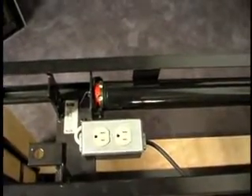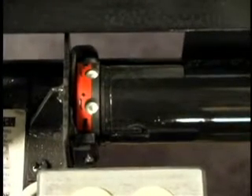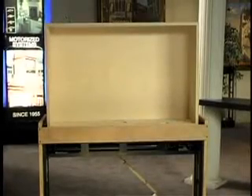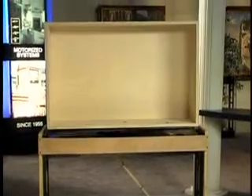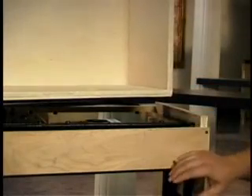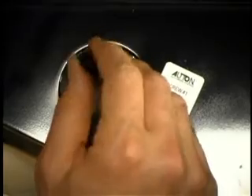The last adjustment we'll be making is to adjust the limit switches, which set the travel of the lift. Remember, we'll access these switches through the two-inch hole you drilled in the base of your five-sided box. The first step is to use the remote to fully raise the lift, then check to see if you have the proper clearance. For instance, if you're installing the swivel unit, make sure the base has enough room to swivel. If it's too low, simply adjust the limit switch to the required height. Now the unit can swivel freely.